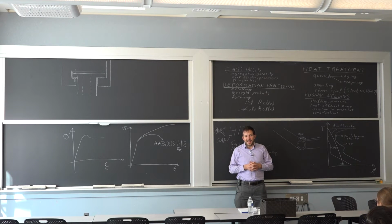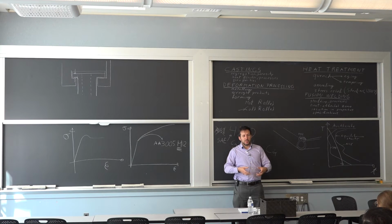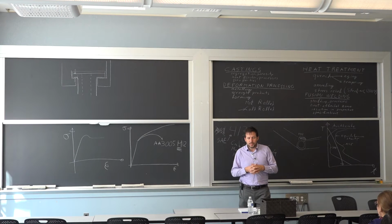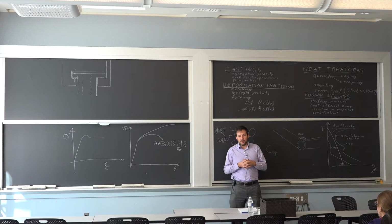If you try to build an alloy, sometimes you can get... we had some tungsten disc for X-ray sources. I remember you could get the pure tungsten or a tungsten rhenium 20%. So what they do is you put a certain amount of each powder if you want to make a 5% mix, because it's going to go to high temperature anyway, and it does get blended together if you cure it enough.